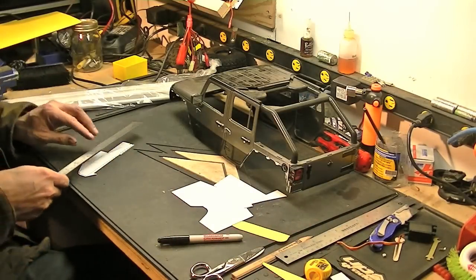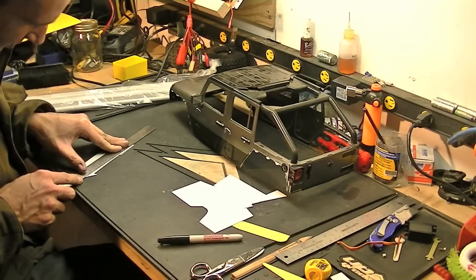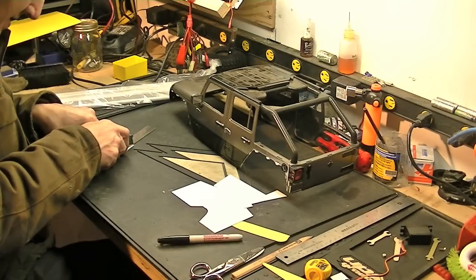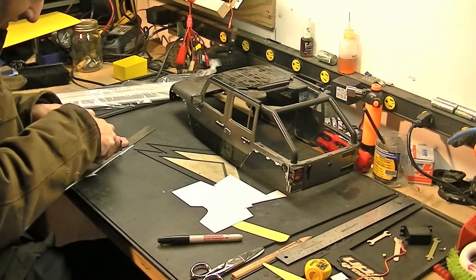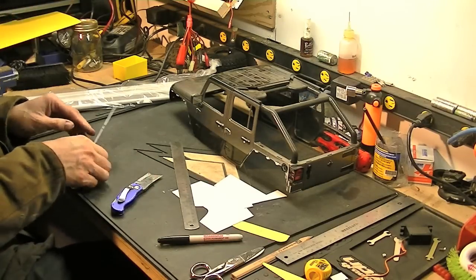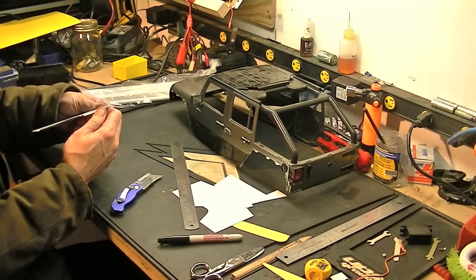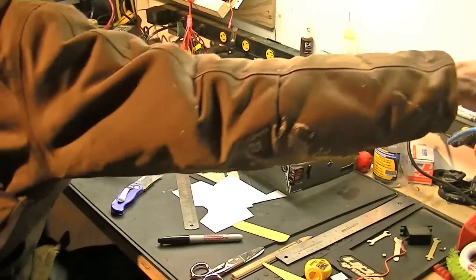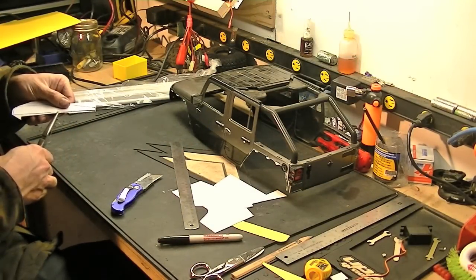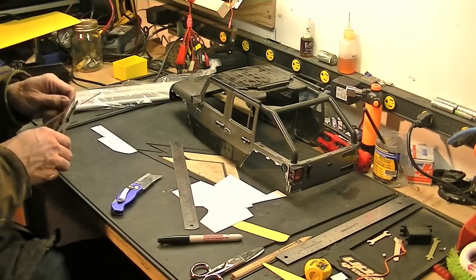What I'm going to do — instead of trying to cut that straight line with the snips — I'm just going to place my ruler on it, take a sharp knife, and run it along there. You don't have to worry about cutting all the way through. Run it along your line, and then just snap it off. It follows really nice, except for where it's really thin, but it's no big deal. Use my pliers — and voila. Nice, nice cut.